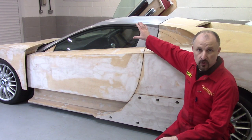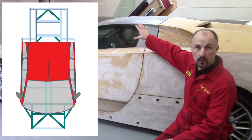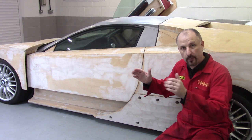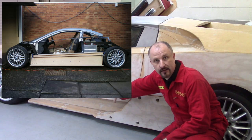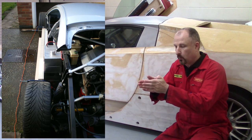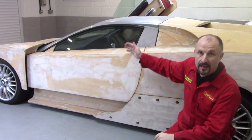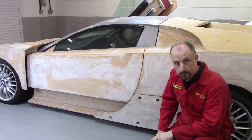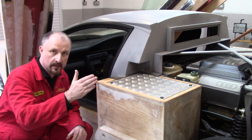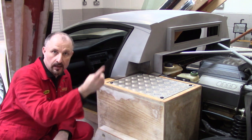With the roof just placed on top of the chassis, I couldn't carry on with the welding and metalwork fabrication until I knew that it was centralised. To do that I needed several datums on the chassis. The next stage was to start making the side pods on each side of the car. The woodwork uses the same template — you cut two pieces of wood out, separate them, and fit them either side of the chassis. I then made the fuel tank pod area using the same technique, cutting two pieces of wood at the same time.